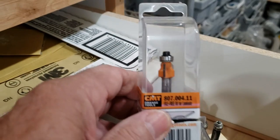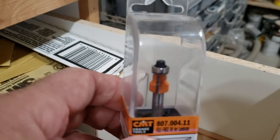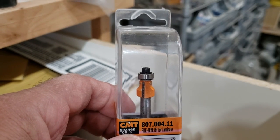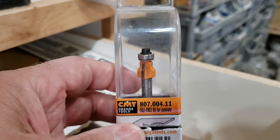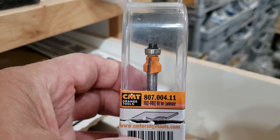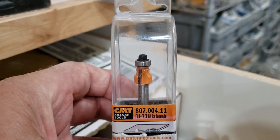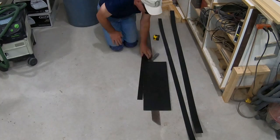The other bit you need is a beveled bit that will trim your finish cut on your laminate at an angle rather than square. The benefit of this is that it takes away material that otherwise you would have to hand file off to take the sharp edge off your countertop. But that's it, and these bits are very inexpensive as well.